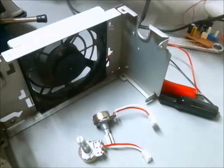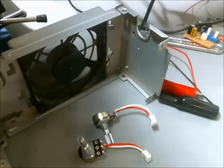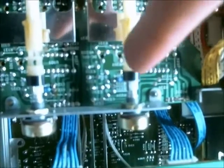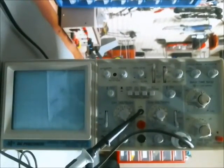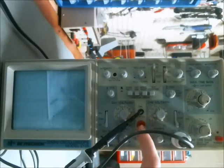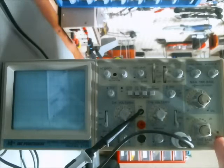I let them dry for an hour, and I added a fan just to dry them a little faster. Now I'm going to put them back in. I placed the potentiometers back into the circuit, each in their previous location, and this time around I'm just going to be measuring the calibration signal, so it's 0.2 volts peak to peak. Let's turn on the power.